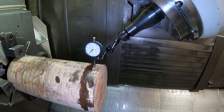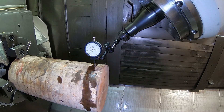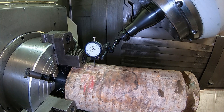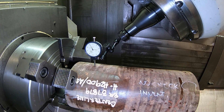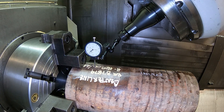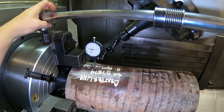This has to come up a little bit too. I'm hitting it pretty hard right now and it's moving, but it's not moving real easy. Okay, so now I've got that pretty close. Now I can start to indicate my runout. If I tried to do that before — I got it relatively straight this way — I would never be able to move it when I really start to tighten these hard jaws. I'm going to try to run this wrench from the bottom because it's right in the way of the camera here.